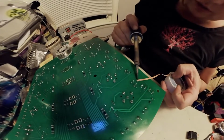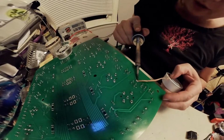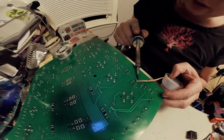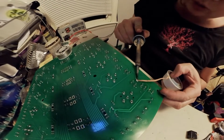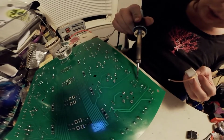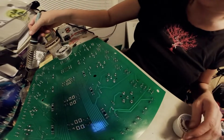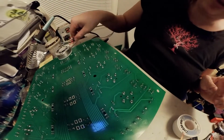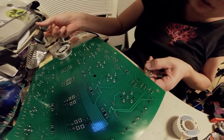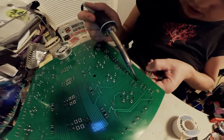And this is a relatively new strand. It's awesome because it's a new strand, but basically it'll pull off all the excess solder and wick it up into the solder wick itself, which allows us to pull off a lot of the extra solder here. You can see how that hole right there showed up? And it's because it pulled it all off. On the newer surface mount stuff, you can do it with a little heat gun. I just am not very diverse with that kind of solder.